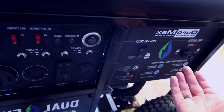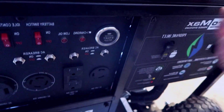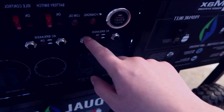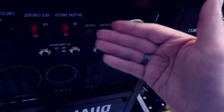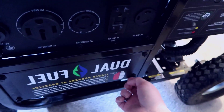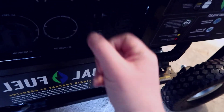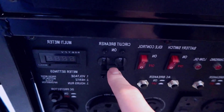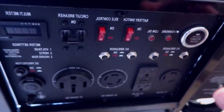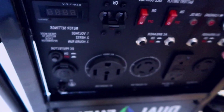I'll show you the cable and how I'm connecting everything. You have your start button here — it works similarly to turning a key in a car. You have breakers that indicate whether they're on. When you're ready, you pull off this panel — four screws — connect a small battery cable similar to a car battery, flip the battery switch on, flip the idle control on, set the circuit breaker to off, start the motor up, and then once idle control is good you flip it off and you're set.